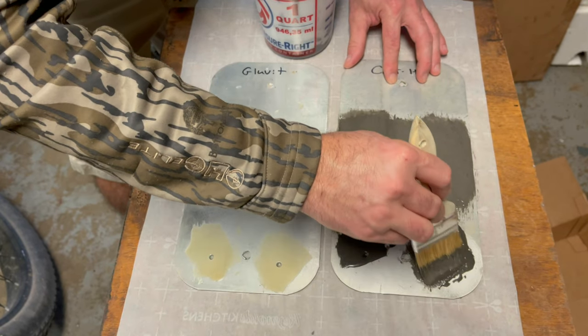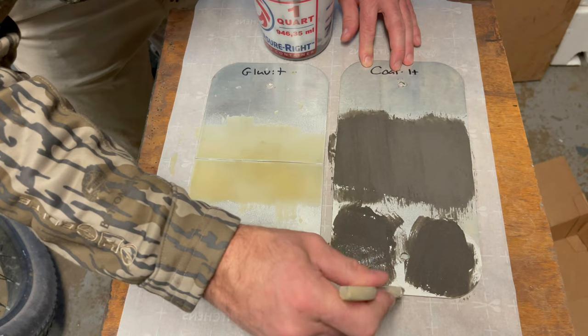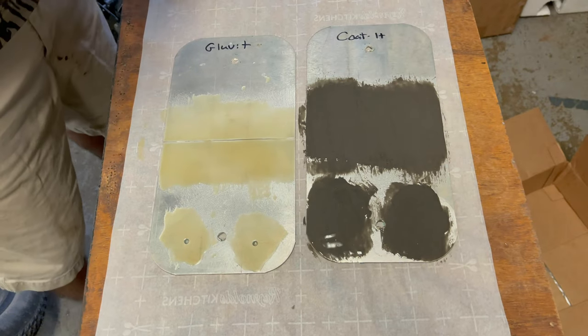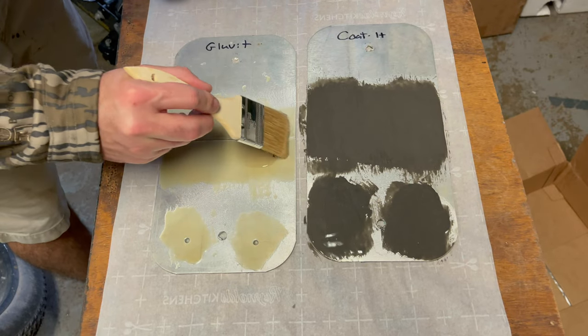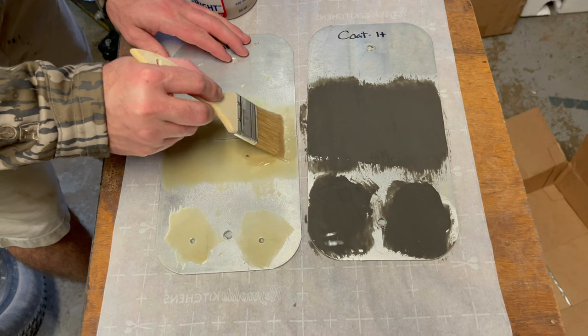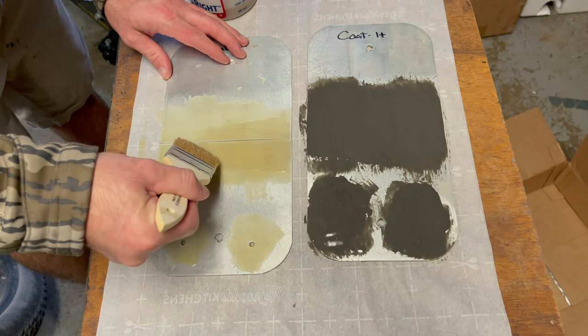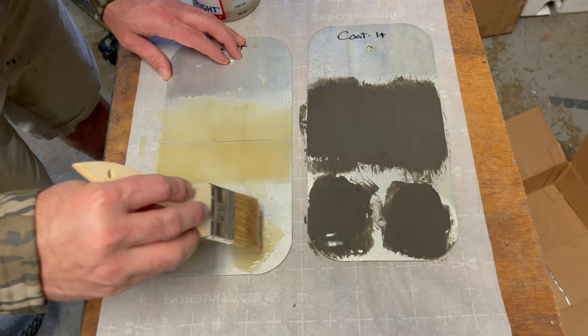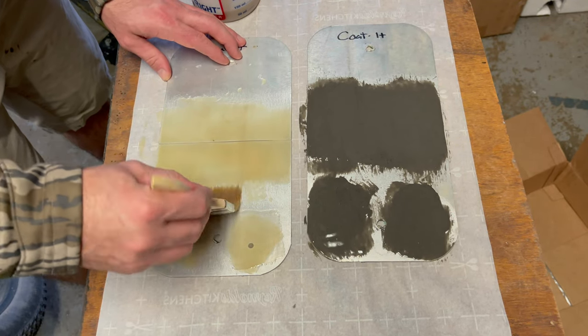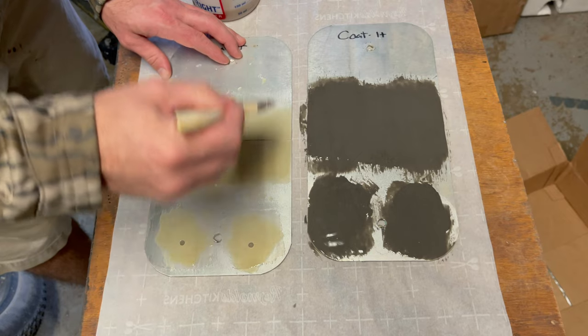Gluvit hardens overnight, allow 48 hours at 72 degrees for maximum strength. Working time and cure time will be longer at lower temperatures, shorter at higher temperatures. Note, if ambient temperature is below 50 degrees, precondition Gluvit to 72 degrees and work area until at least 50 degrees. Gluvit may be applied over mildly damp and not wet surfaces.